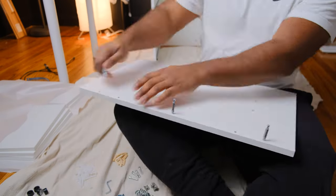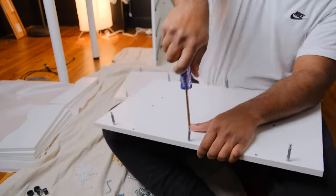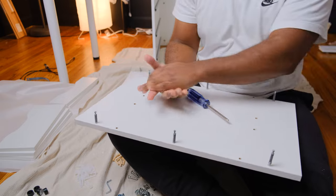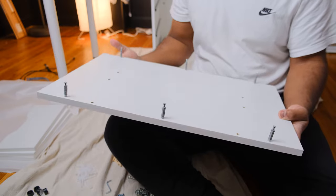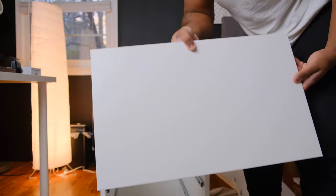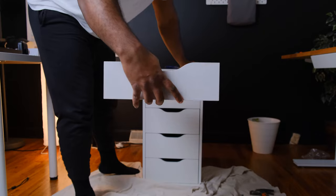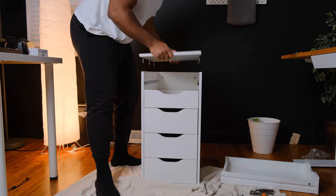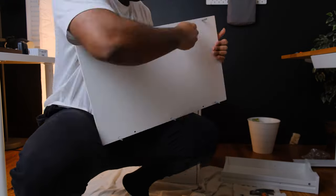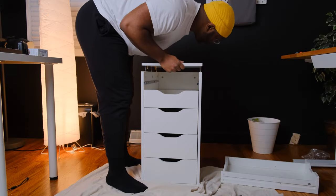Then do the exact same thing on the other board. Even with the screwdriver, my palm was getting tired. This is a good point to check your work because this is where I messed up — I overlooked a step and didn't put the wooden dowels in when placing the top board on. I had to take the drawer apart to put the dowels in. The drawings say to have the wooden dowels on the other board, but it all connects together in the end. In this case, just go by the manual.